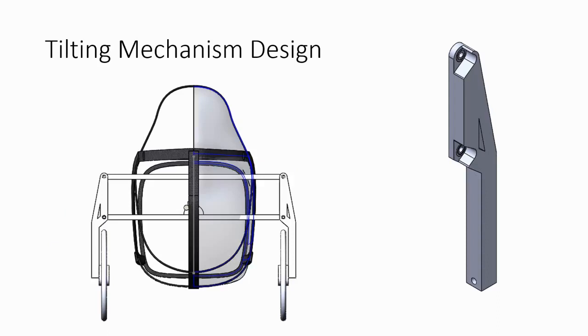Shrike is a delta trike with a tilting mechanism developed for the back two wheels. This mechanism is composed of two horizontal bars that will slide as a parallelogram to allow the bike and wheels to tilt together. The most important part of this design is that the vertical sidebars are designed so that the wheels are in line with the ends of the horizontal bars.